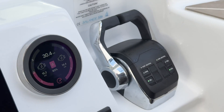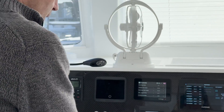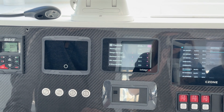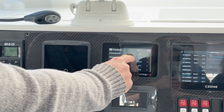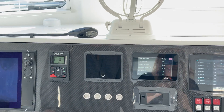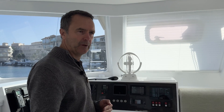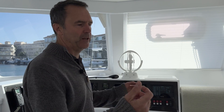So I've got the charge rate limited to 30, but if I start to drop this down — let's drop it to 20 — you'll see this power drops back to around 20 kilowatts. It's a target, not absolute. If I wanted to drop this back to 10, it'll pull it back. One of the reasons to do this is to limit heating on the motors themselves — they're air cooled, not liquid cooled. So if you run them really hard, they will hit a thermal limit and then they'll self-limit their power to cool down.